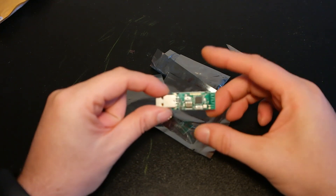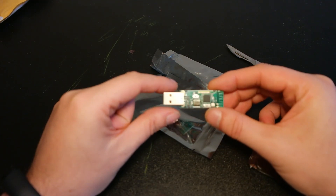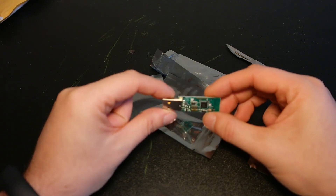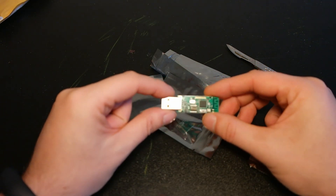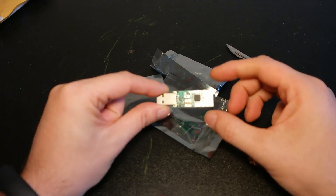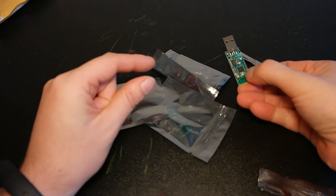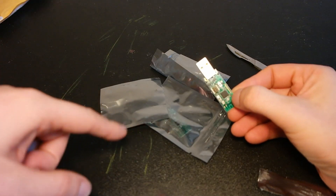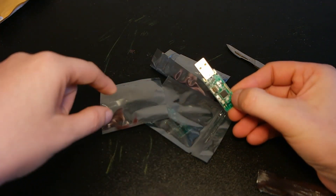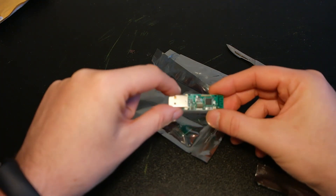Don't forget to follow me and subscribe — you'll get a notification when I make a new giveaway. This is a typical Zigbee USB module. I use it in my setup with the Raspberry Pi, but I also use it in a Synology setup. In the giveaway, I'll be giving these modules pre-programmed with the latest firmware. If you buy them yourself, you'll need additional modules to program them — you insert the module into the computer, use a programming interface and an RS232 connector, then use Texas Instruments software to upload the firmware.